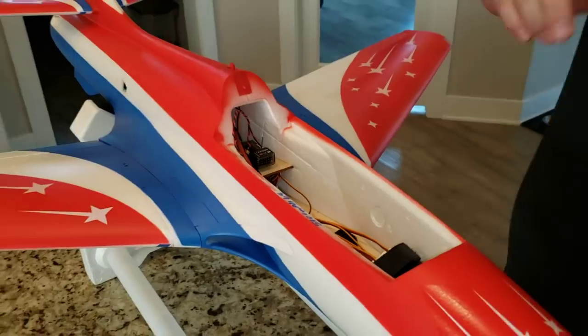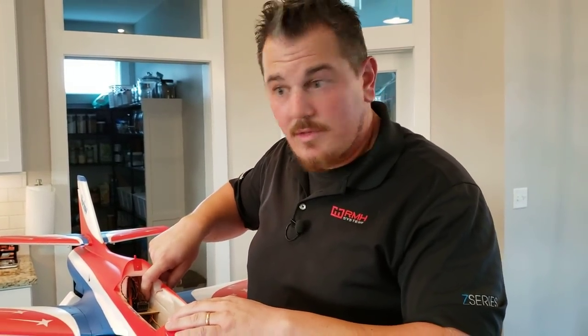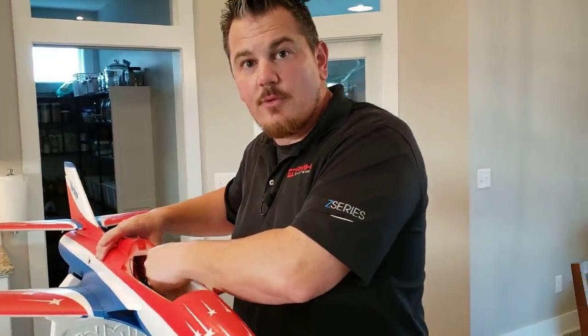Okay, so let's talk antenna for a second. Antennas are a coaxial media. So they have a sheath on the outside, and then there's an antenna that goes through, and then there's another thing that goes on the outside, and it's a shield, okay? And that helps to pick up noise that would otherwise be picked up through the receiver inside, okay? So then at the end, there's a thing that bites on and a pin that goes through the center, okay? So it's actually two conductors. There's an outside conductor that grounds, and there's an inside conductor that carries the variable information that's being picked up. And that is like 28 millimeters of exposure, okay? It's got something to do with the wavelength of the actual RF that's being carried, the radio frequency.